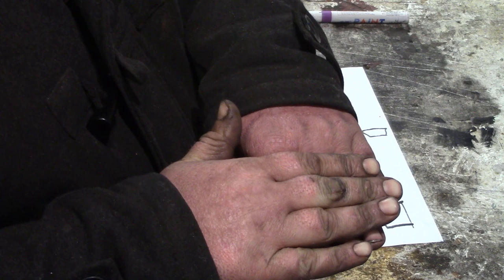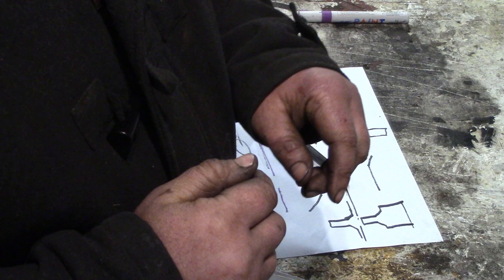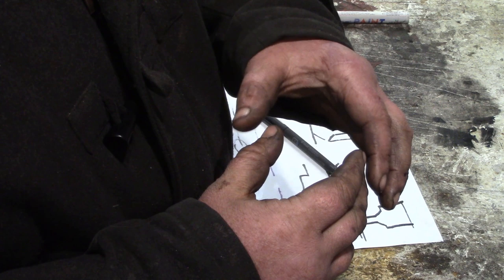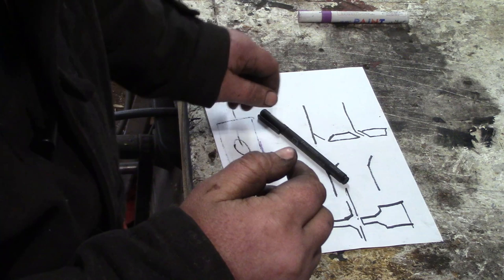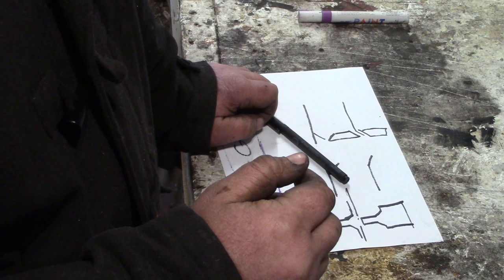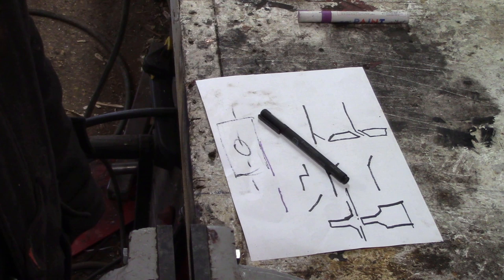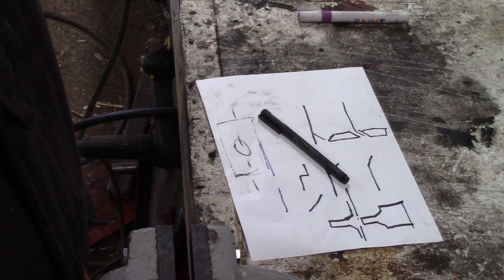If you think about countersinking a hole on an aircraft skin, especially something that's pressurized, for instance, if you countersink it by removing material, you're actually reducing the thickness of it quite significantly where you've got the fastener. It famously caused lots of problems for the de Havilland Comet, didn't it? The whole thing fell apart through fatigue when it pressurised, because people hadn't been making large pressurised fuselages before, and they were using the same countersinking processes that they'd always done on smaller aircraft. Either way, we're going to build that type and hit it with a hammer.